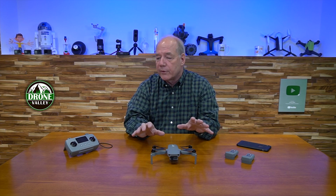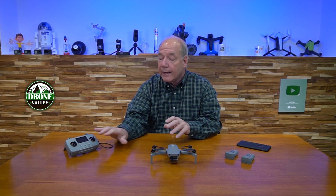So far I've gotten three firmware updates for the drone. I haven't seen any updates for the controller or batteries yet. Before you do a firmware update, always read through the release notes so you know what's being introduced. In some cases, you may want to wait a week or two and check the boards or our channel to see if anything funky happened with that new firmware, because the last thing you want is to push firmware to the quad and lose functionality.